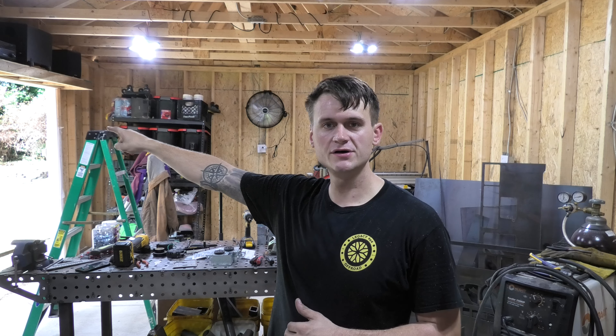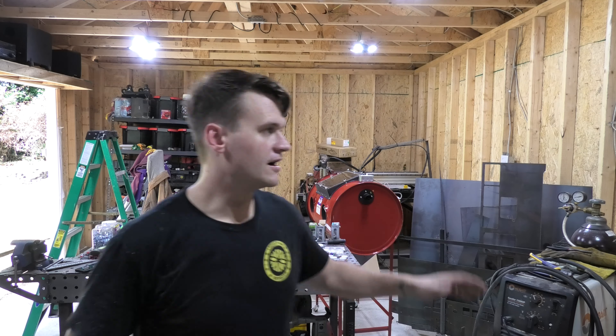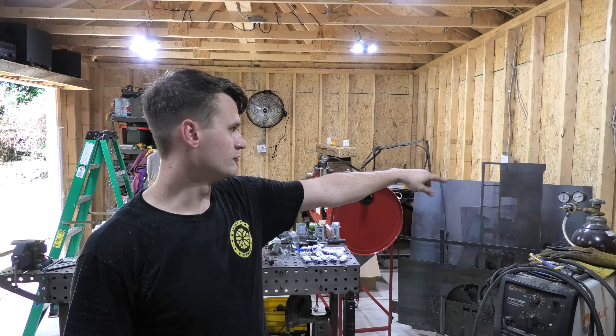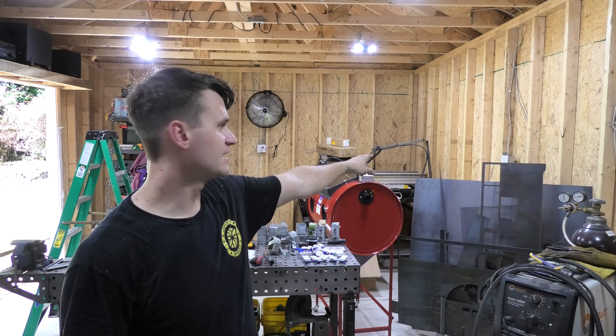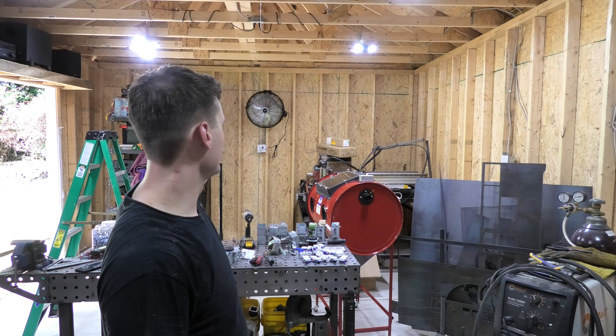That finishes off the 115 volt wiring in the back of the shop. On the barn door side, closest to my house, I added the light switch which controls all the lights inside the shop as well as the exterior lights. I also added a 115 volt outlet up high next to where my speaker system is — that's where the speakers and probably the electric reel for my extension cord will plug into. On the other wall I added a standard two-outlet box, and next to it a four-position outlet a little farther down the wall — so there's a total of about six outlets on the back side of the shop.